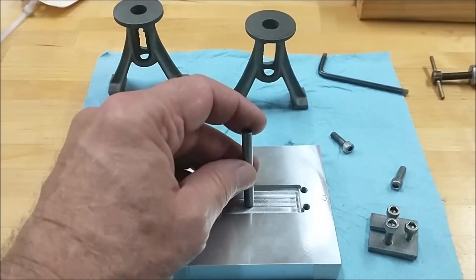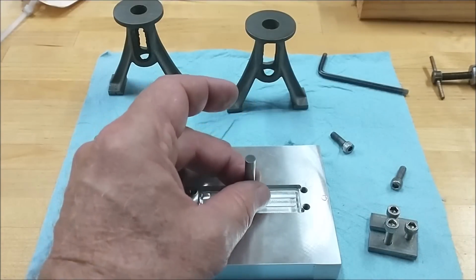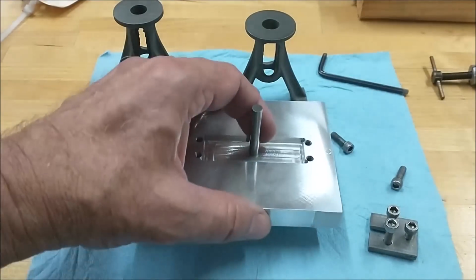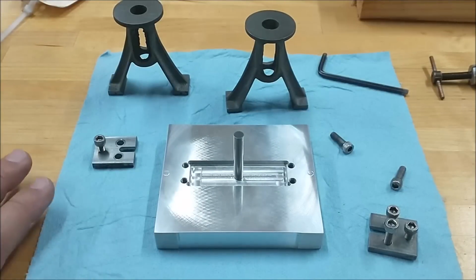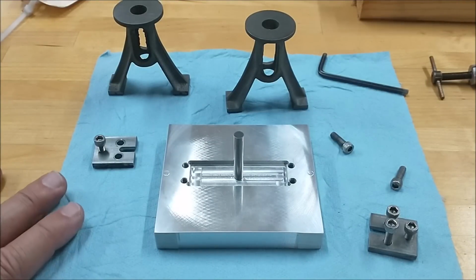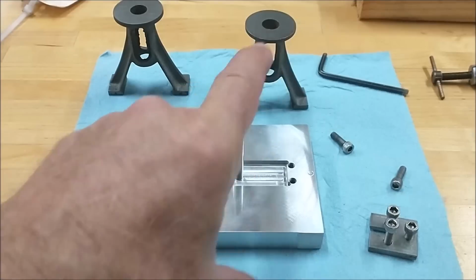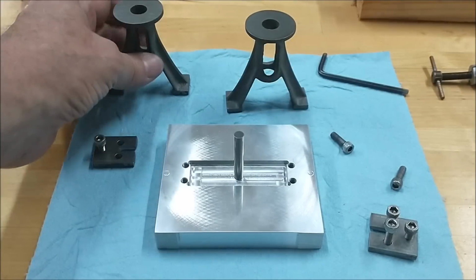So let me hang this pin in a tailstock drill chuck. Set this up in a 4-jaw. And you may have to come back for this one. I am running out of time. But let's get this thing set up, and I will promise you I will lead off the next video with the boring and facing and drilling of these towers.